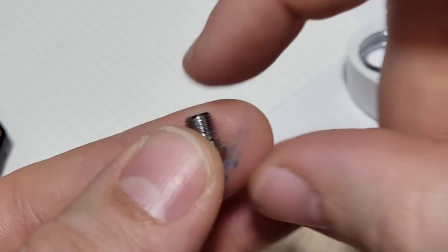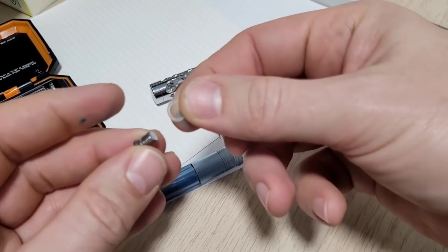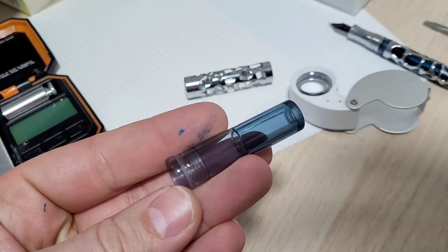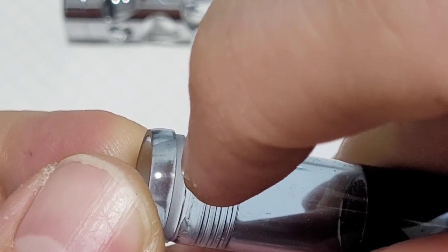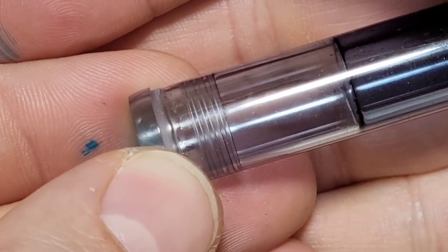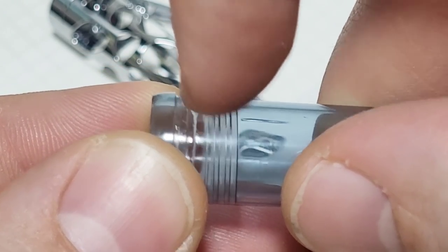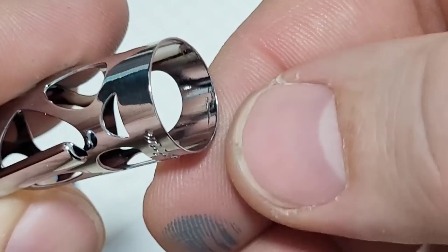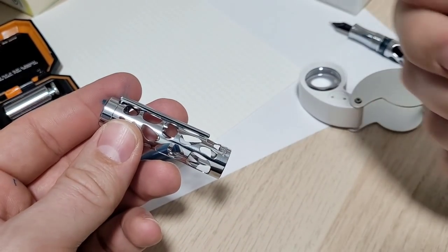If you have even a slight flaw and someone gets in there with a screwdriver — and the cap is close to the ink — you can get condensation, moisture, and that can rust out. Also it's quite long, which is why there's so much headspace up there. If you had a shorter screw with a finer pitch thread, you could get rid of some of that material up top and make it less top-heavy. I do like the O-ring — it's captive so the thing doesn't fall apart. Also, the glue holding parts together didn't have proper surface preparation on the chrome side, so the glue won't stick.